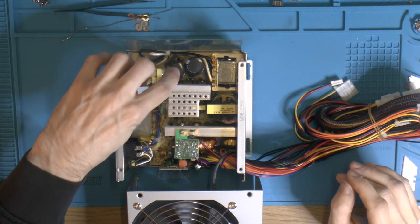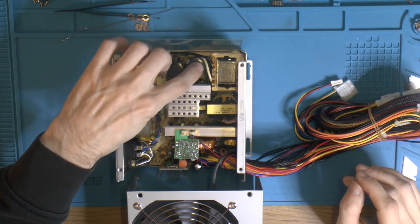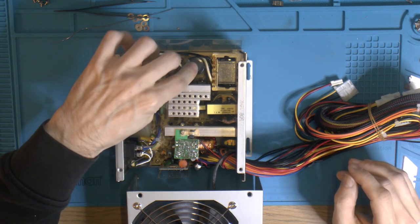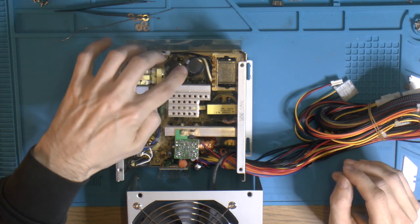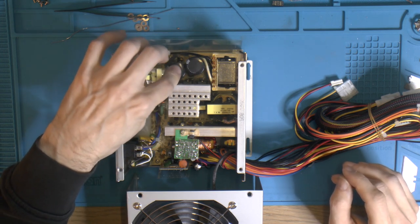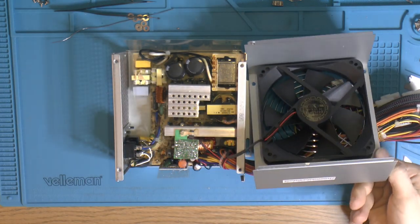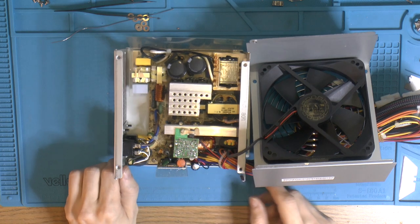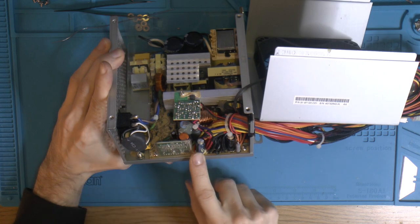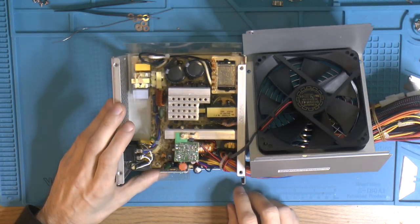These are not swollen, I think, because they felt like it was swollen, but it's just a plastic cap flexing. It's like a dome, but if you push them down, it's fine. So I can desolder these and check if the actual capacity at least is like what they say. If that's way off, then we're probably bad. So yeah, the plan is to replace as many caps as you can. The brand that seems to have swollen and leaked is called Yamicon. I haven't seen any other brands leak or swell.